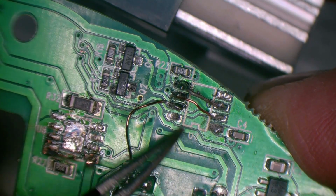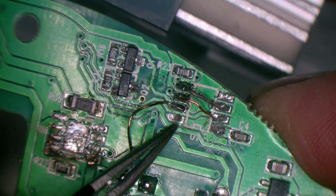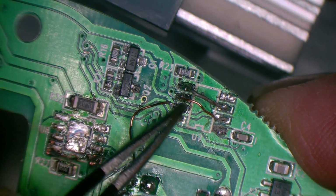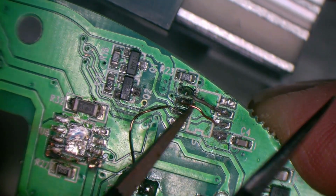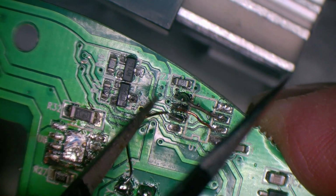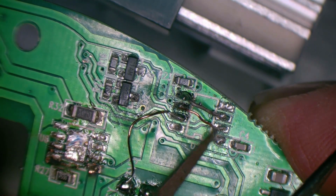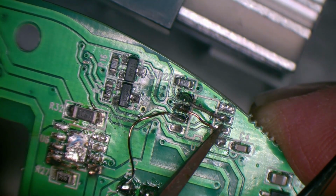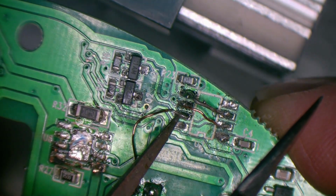So what kind of IC would take a signal in and invert it out there, but not out here? And how does this pin tie into anything? There's a third pin that's not used. So what logic tells this to turn on only perhaps when there's drive, when there's enable signal? That would make sense. If there's enable signal, pass that through and also turn this on fully.